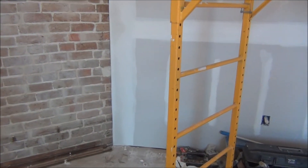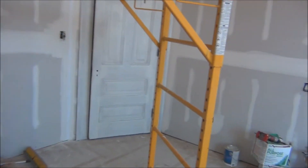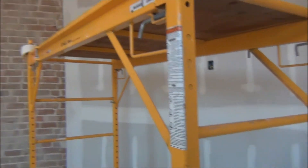Next thing they're going to do is sand some more Monday, put some more mud on it, finish it off, and then put the first coat of primer. So next time you see a video it'll all be in primer. I'm going with a Sherwin-Williams wallboard primer - it's kind of thick. This is a level 4 finish; I don't want a level 5. You don't really need to be that smooth because I want a roller texture - no spray texture, just what the roller puts on.